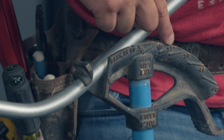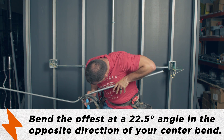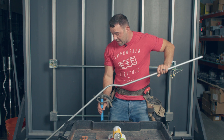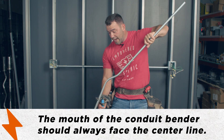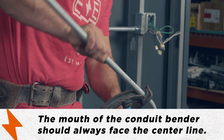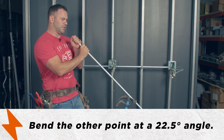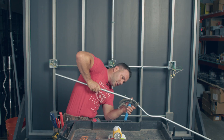At your next mark, rotate it. Why rotate? Like a 45 or 30-degree offset, if you don't rotate and keep the conduit straight in line with your next bend, it dog-legs — pops out to the side. What's half of 45? 22 and a half. That little 22-degree mark on the bender is specifically there for a three-point saddle. Bend it there in the opposite direction, then flip the conduit — mouth always faces the center line.